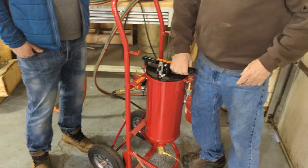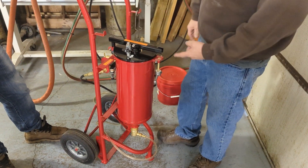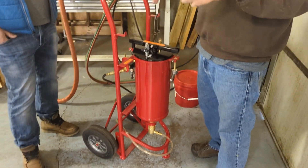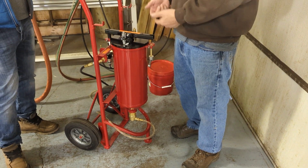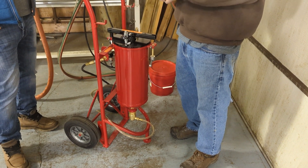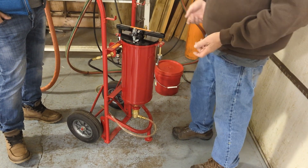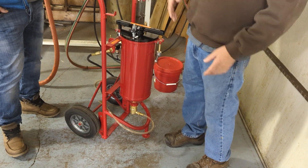Here's the thing — if you're not going to use this every day, you need to empty the whole canister out. Daily? Well, maybe not daily, but in the summer when it's humid, yes. Because the iron powder is going to rust in there, turn orange, form a clump, and nothing's going to flow. So if you know you're not going to use it every day, you need to turn this upside down or take the cup off the bottom and dump it all out to make sure it's gone.